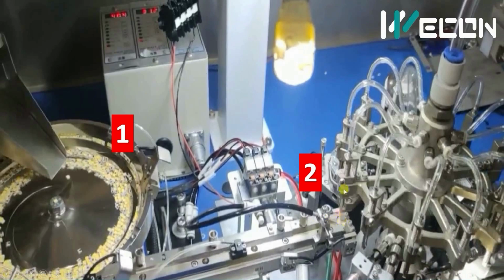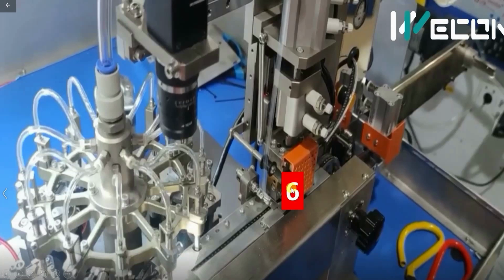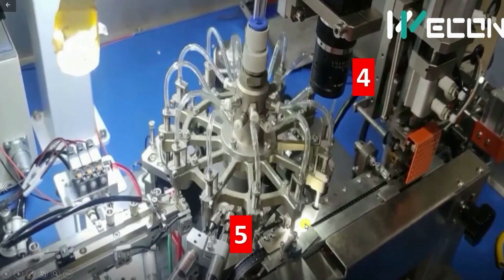Here, LEDs are picked up by creating a vacuum and then the table rotates. And finally, after rotating, this is station number 3 where LEDs are dropped on this conveyor, and this is the vision sensor where it checks for damage. If it is not damaged, then the conveyor will move forward, and this is station 6 where LEDs are packed. And if the LEDs are rejected, this will again create a vacuum and take the LEDs to this section, that is station number 5.